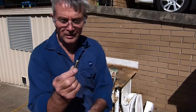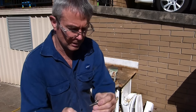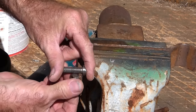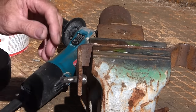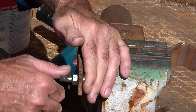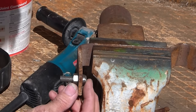Right, we've made the rivets. Now I need to cut them to length. To make it nice and simple, I've got a piece of steel in here — this is the width I want prior to the nut. So all I've got to do is drill a 3.8 hole in it, cut it off, and every one of them will be the same size.